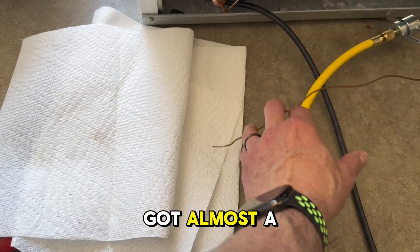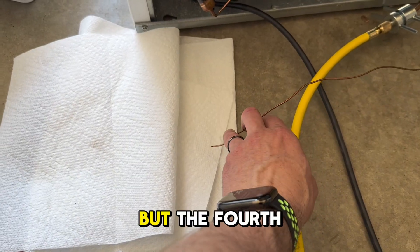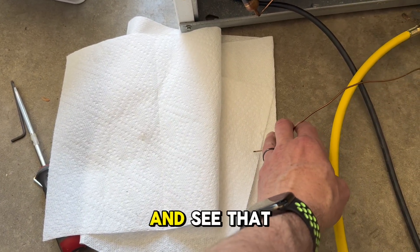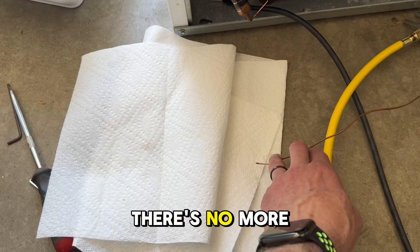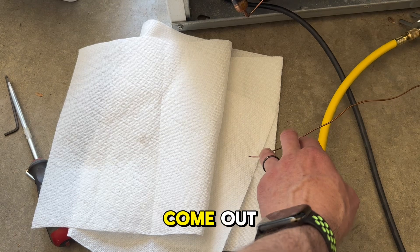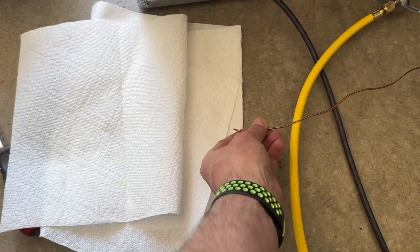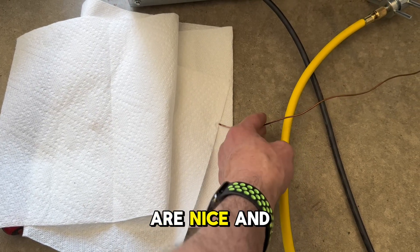The first time I did this I got almost a full width soaked and most of it was still brown. But by the fourth or fifth burst, just about a circle's worth came out and it was nice and clean and clear. That last burst — we didn't get any out, so I'd say we're about clean now. There's no more acetone left in the system, the last five bursts have all come out totally clear, and we've got good strong airflow. Our cap tube and evaporator are nice and cleaned out.